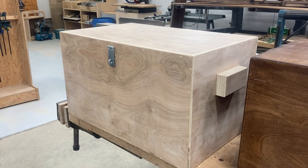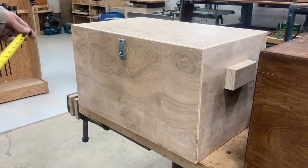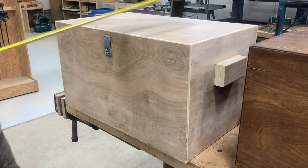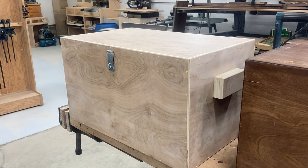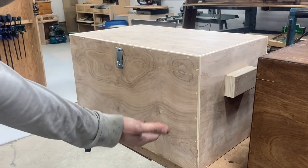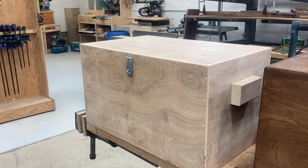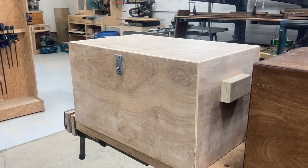To start this box, you're going to use a half-inch sheet of birch plywood. In general, the box is about 24 inches wide, about 14 inches tall, and 14 inches deep. That's all relative — if it ends up being a little different size, that's fine. In general, 24 by 14 by 14 is what we're going to try to lay out, and whatever it becomes after we make things fit is what it'll be. Everyone's might be a little bit different.